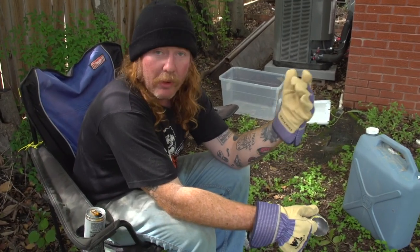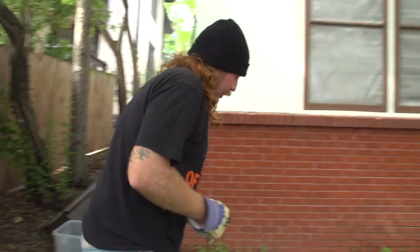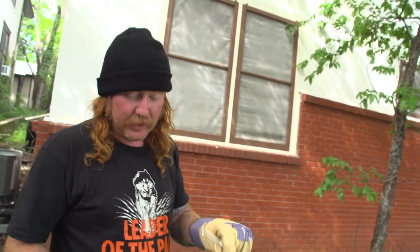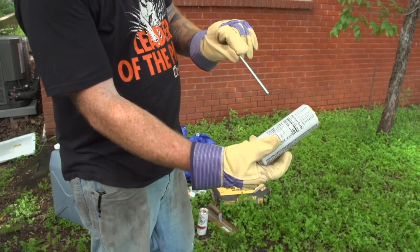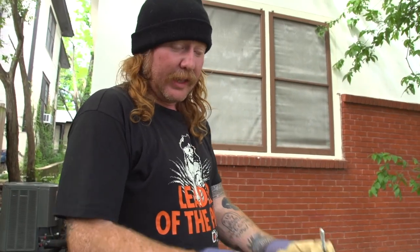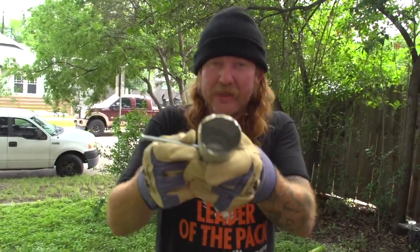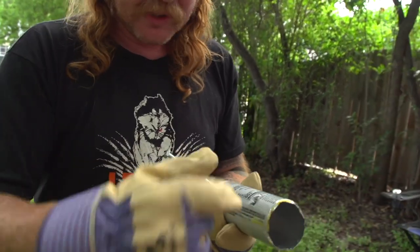You can use a thick screw or something similar, but I went to Home Depot — these little hex bolts work just like rebar. It's cheaper, you don't have to cut it, and they come in whatever length you want. I got five-inch by quarter-inch. We're gonna poke these into the can so they're sticking out, so when we go to pour our ramp they have something to hold on to. You kind of want them to go through without touching the edge of the can, because then it might stick out of the concrete. We're gonna put two of these in.